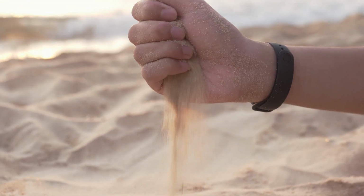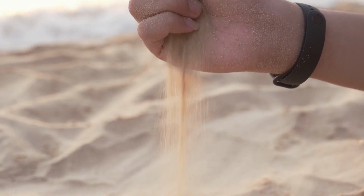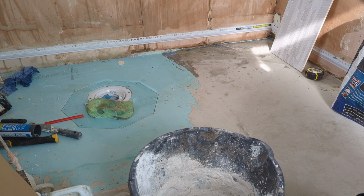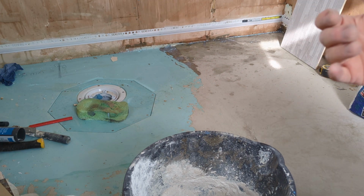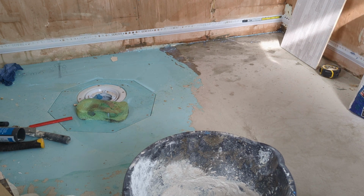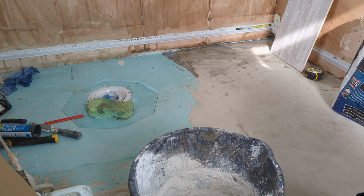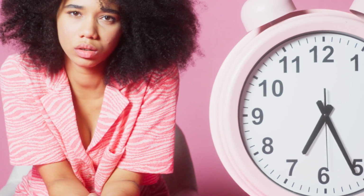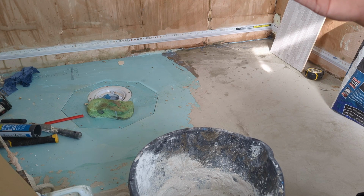So if you've got an uneven wall, it allows you to put extra adhesive behind the tile and it will hold and set. So it allows you to pack out the wall to try and flatten it as you tile. You can't do that with a ready-mix, I mean, you can have a go, but the problem with ready-mix is it air dries and it will dry from the outside first. So once you've tiled it, you've got to leave it 48 hours before you can even grout. If you put it on too thick behind the tile, it could take weeks to set. So if you try and pack an uneven wall out with ready-mix, 2 weeks later it's probably still not going to be set behind there.